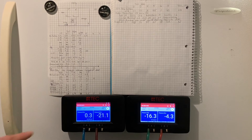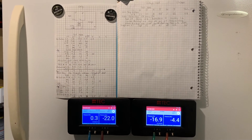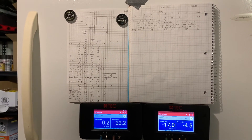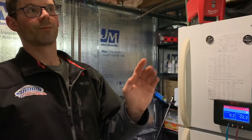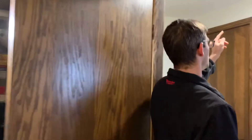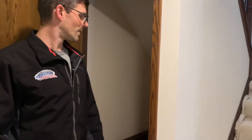This is going to be the one that's hard to reach and there's a lot of settling in that area too — it's kind of tied to the garage. So worst case scenario, I'm going to put a T in the pipe with a cap on it, and we'll be able to run a two inch pipe over the hallway and drop a suction point in there. But I'm really hoping we don't have to do that because it's a lot of work.